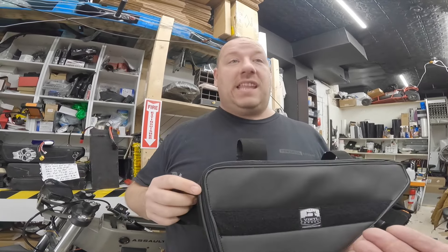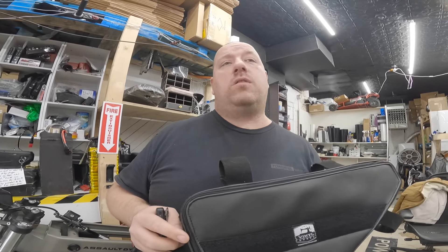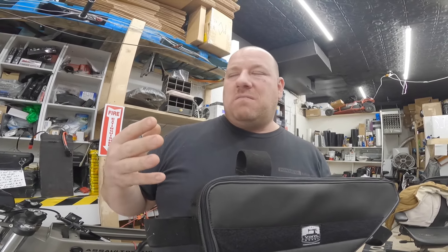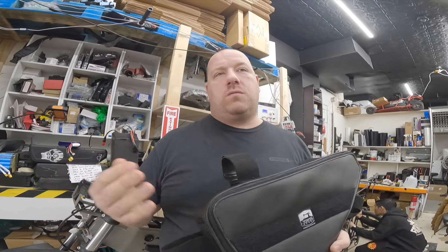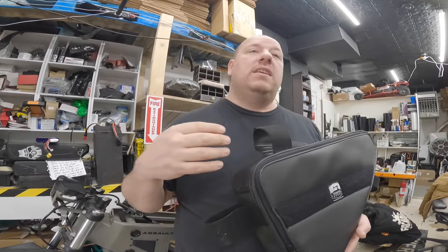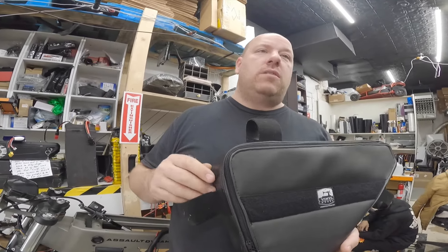So to clarify — it's a 60-volt, 60-amp controller, and isn't that going to be a lot more powerful than what he has now? Yes, he has stock now. So he'll have more torque, more range, more acceleration. This guy is concerned about good range, not speed. Speed should be around 45 to 48 miles an hour — we'll see. We're going to do Samsung 50E cells because we don't need crazy discharge. He's going to have a lot of range — comparable to an Onyx battery but at a lower voltage. It should easily do well over 100 miles.